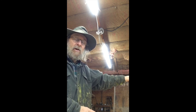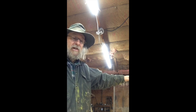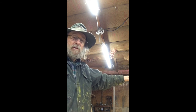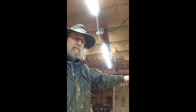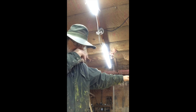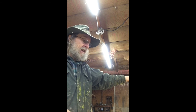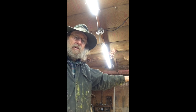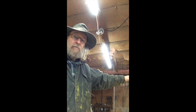You'll have a clear window all winter long. You can leave them in during summertime too if you have central air conditioning and don't open the windows much - it can actually help keep the heat out as well. We have large picture windows in our house that don't move, so I made frames almost four feet by eight feet out of thick pine and put them in - they've been in there four or five years now. If you take care of these they can last. Just make sure you keep the area between the windows free of moisture before you seal it and you'll always have a nice clear view. Thanks for listening.